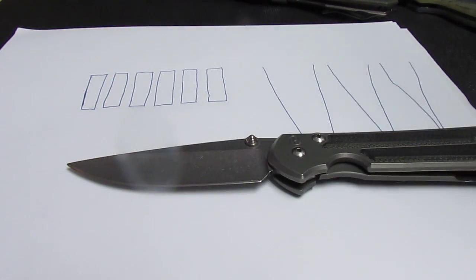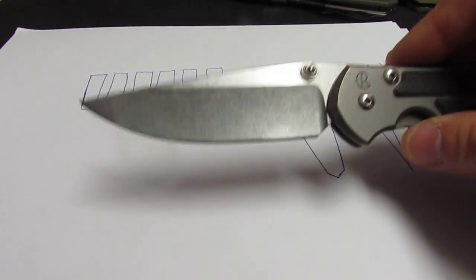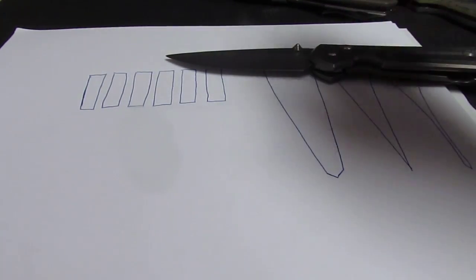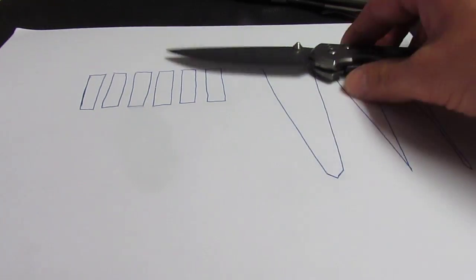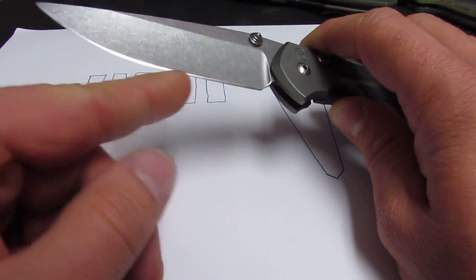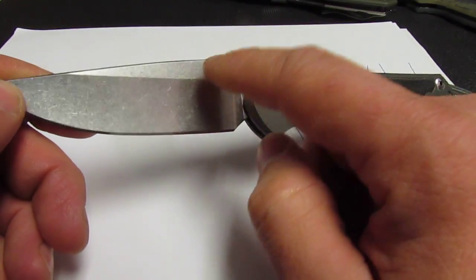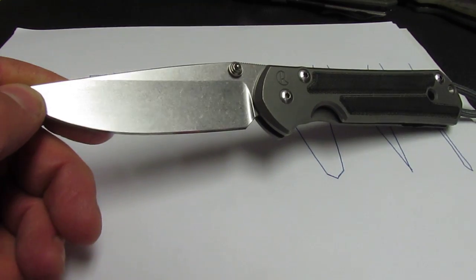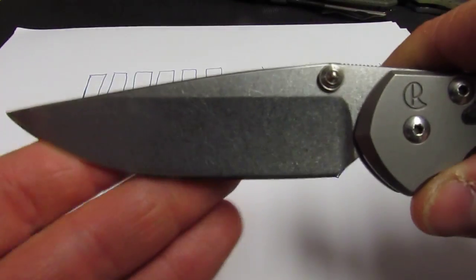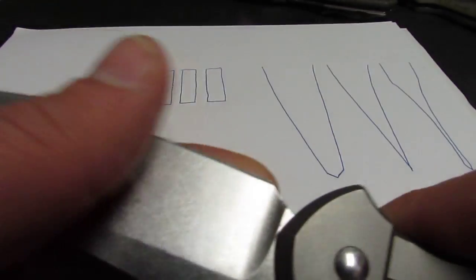The very best selling point to me, besides that they cut really well, is that properly done hollow grinds, such as a properly done convex grind, cut, and they cut well. They're proven performers. Hollow grind sharpens up so easy because you're on this very edge. I actually use a convex micro bevel, so I can sharpen this up on a diamond strop very quickly. And if I get a huge ding in it, which I don't with Chris Reeve knives, I could sharpen this out very quickly.